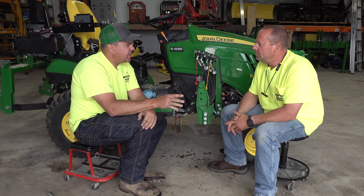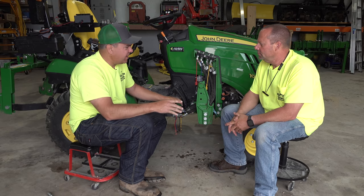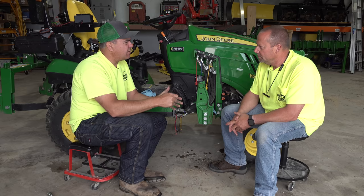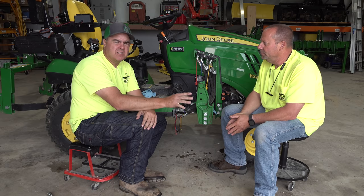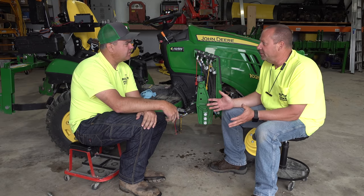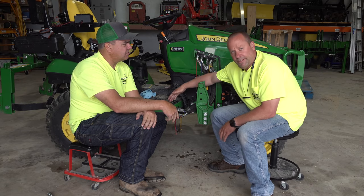Okay, next question, Ken. My loader, I'm ready to take it off, and I have trouble disconnecting these, or I'm trying to connect them up. I'm trying to put my loader on, and I push as hard as I can, and I can't get these things to go in. Get this question all the time. Yes. What do we do? We have pressure in the lines, either on the loader side or on the tractor side.